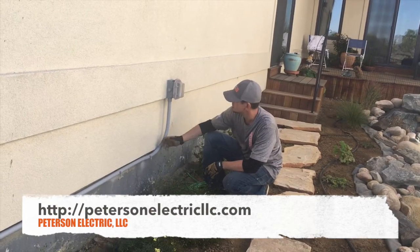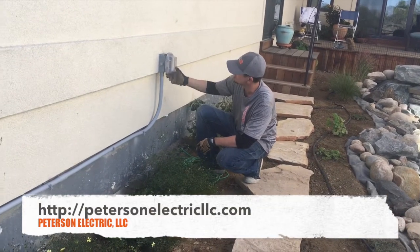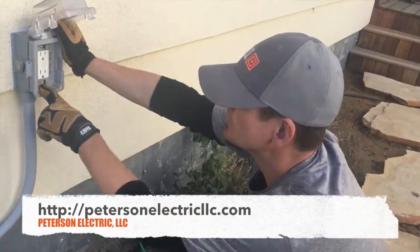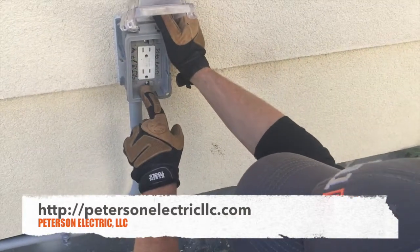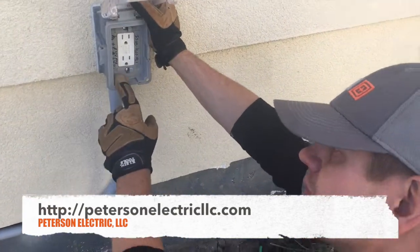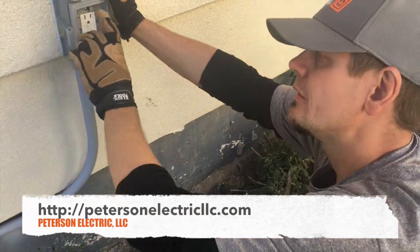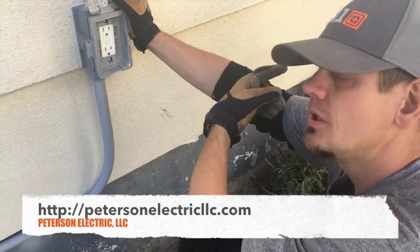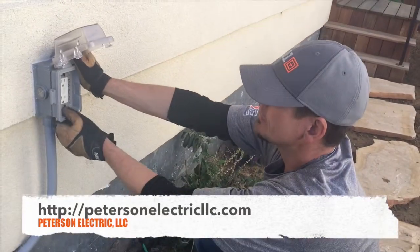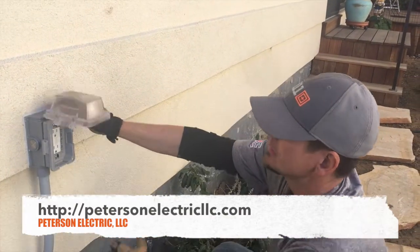When we bent this conduit, we did a quick 90 with an offset kick and went right into an extension off the box that was already in there, allowing us to come three-quarter inch into the bottom of this box. Here's what to pay attention to: we labeled our circuit — we always do that. Circuit 27. This is a WRTR-rated GFCI outlet, 120 volt. It does not have to be AFCI unless this receptacle is sharing space inside a livable area under the 2010 NEC, in which case it would need to be AFCI at the beginning of the circuit. Since it only feeds out here, it's GFCI only.